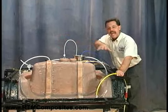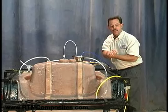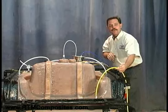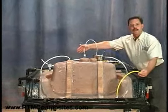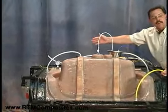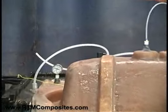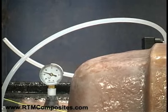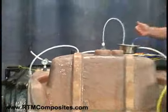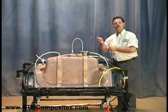We have the yellow line — 10-millimeter, three-eighths line. That represents our full vacuum. The black area around the mold is the clamping flange; that's what's helping clamp the mold surfaces together and hold them there, so we have this at full vacuum. On the gauge you're at about 23 inches of vacuum. That's adequate, but we prefer 29 or greater. Below 23, you start to become marginal.